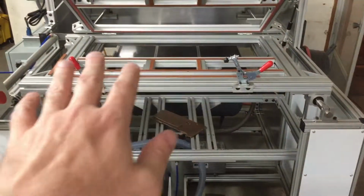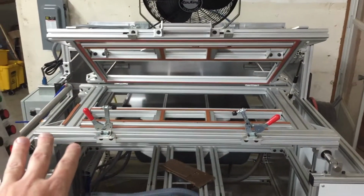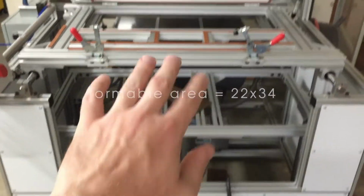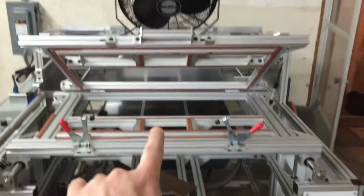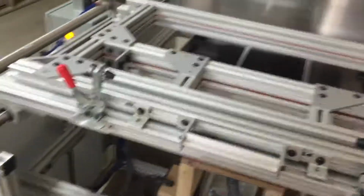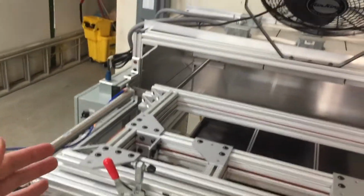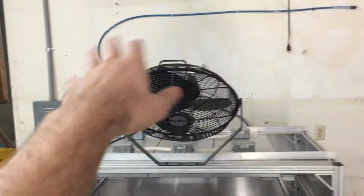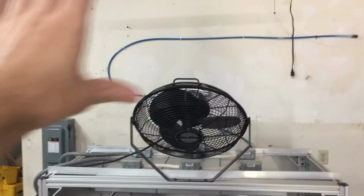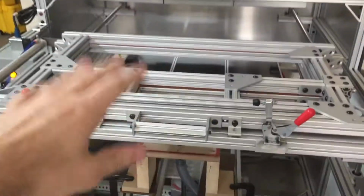Ours is a 24 by 36 inch machine. It had the option of upper and lower heaters. Upper heaters, lower heaters are optional. I'm not sure if I mentioned this in one of the other segments I recorded, but this machine had an option for an upper platen, and that would be a big arching thing up top, another air cylinder. It had more travel, I think it was the offer on it, and you could go down. And that has different benefits.